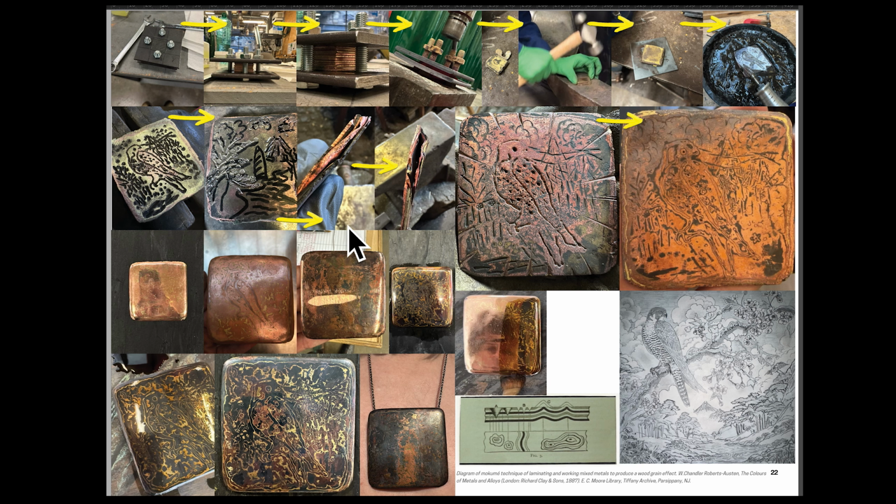One thing I forgot to mention about the process of creating this was a failure at the final stage, which was I had it perfectly polished in this plate. This is pre-patina, and then I tried adding a patina that I usually use, liver of sulfur, and that's what this looked like, and it really did not look good at all.